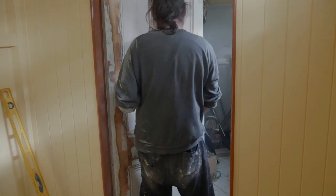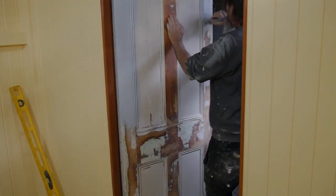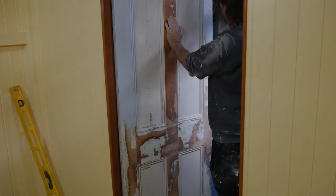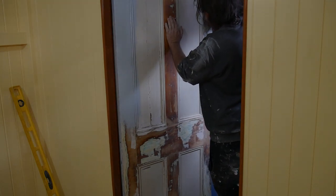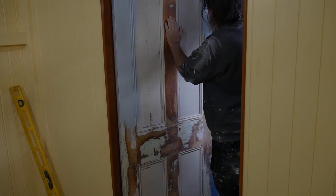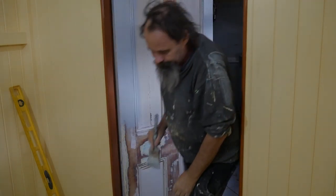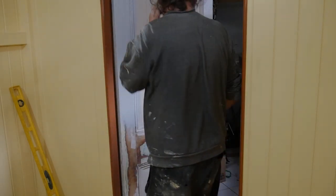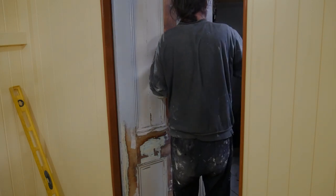Sanding leaves a lot of dust on the surface that must be removed before painting, because paint doesn't stick very well to dust and even if it did the finish wouldn't be as good. We firstly apply an oil-based primer undercoat. This is mostly necessary for areas where there's bare timber, but where there's old paint it also helps the top coat stick better. Oil-based paint is the best for doors because it dries harder and the door won't stick to the jamb. It also allows for a much higher gloss finish, which looks nicer on this style of door.